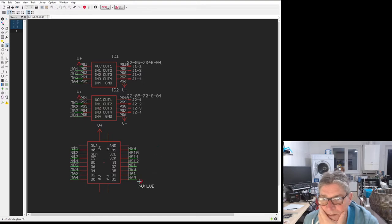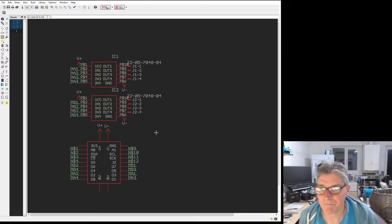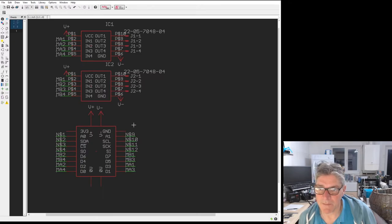And that's different from ground in this case. So these are the high current supplies in that 50 pin connector. So the motor has its supply. Ground and V minus will effectively be connected together, but they can be isolated on a tile. However, you've got to be careful about mixing different tiles if you're using isolated and unisolated tiles. But it is possible to do that.